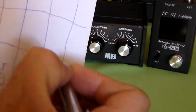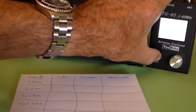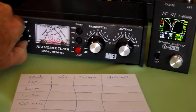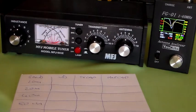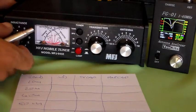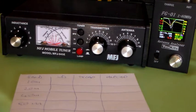This is just extremely rough, as you can see. But all you need to do is, if you've got yourself one of these little antenna analysers, put the tuner into a default position, which is A — maximum inductance, and both capacitors set to 50%. There's no weight in that tuner at all, and we'll cold-tune it with the little antenna analyser.